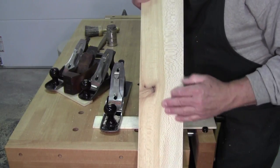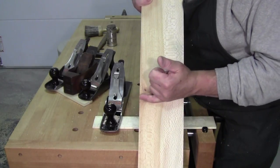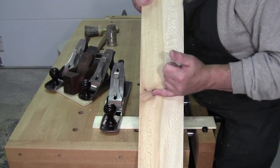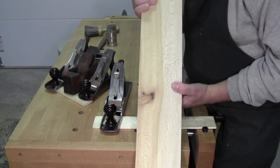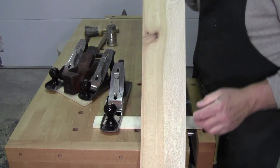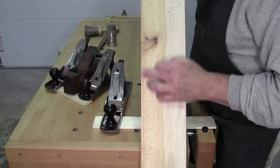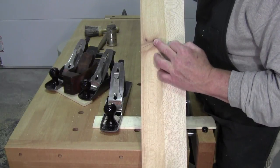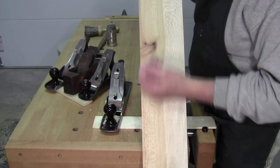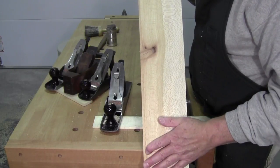But as you can see, I planed right through that with no tear out — except on the crack that's in the center of the knot. So when you're planing any wood, if you can determine the direction that those knots grew, you want to plane with that direction, just like that. And that will eliminate a lot of your planing problems.